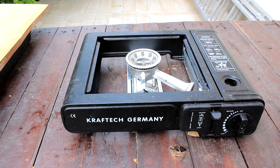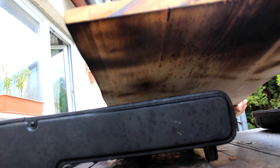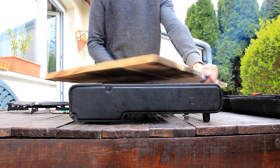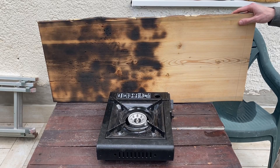Now I want to show you a really cool technique used to harden softwoods — burning the wood. They usually use roofing torches, but I only have a small propane burner. The difficult part is I can't see what I'm doing, so it's basically guesswork: burn a section, look at it, burn another. Eventually I started seeing progress, though at first placing it onto the burner left a spotty finish — that will probably be the underside.